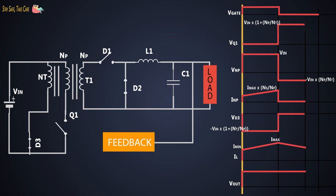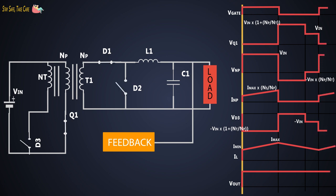After some time, the transformer resets and the voltage across the MOSFET goes down to the input voltage. Now the polarity of the voltage is reversed — the voltage across D3 will be –VIN. Similarly, the voltage and current across the primary winding of the transformer will be zero. The current of the inductor keeps decreasing in this phase as well, providing power to the output and maintaining the load voltage constant. So there are three steps of working of a forward converter, and this process repeats every time to get constant power at the output.